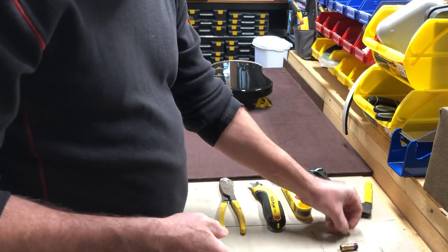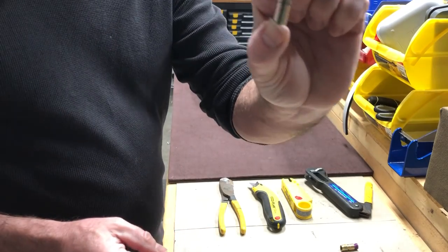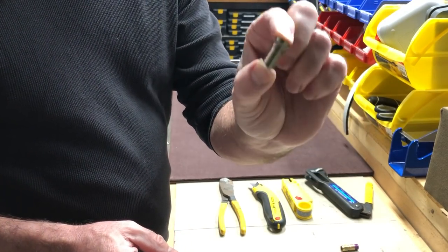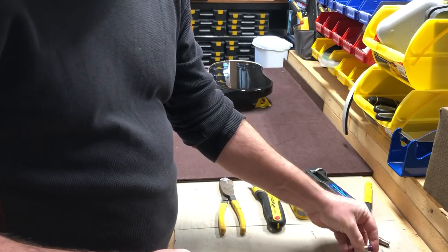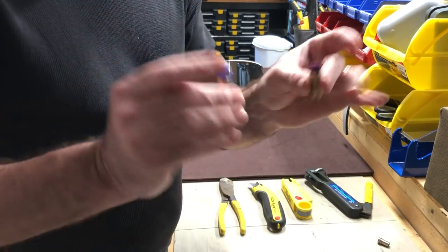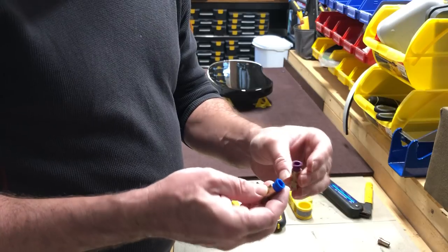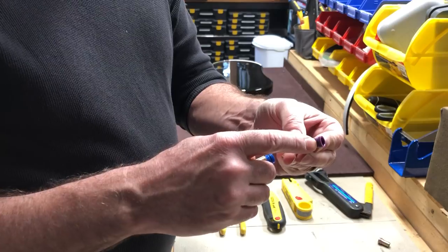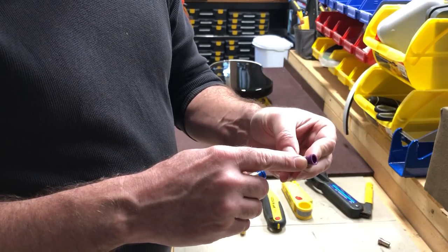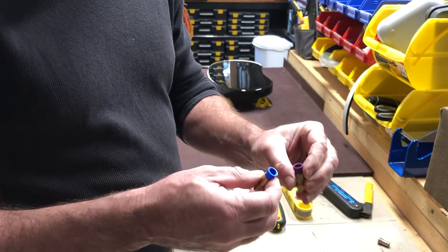The type of fittings — this is a really cheap F fitting, I don't even use these anymore. It's a crimp type fitting. I use waterproof F fittings. They come in different flavors and quality levels. These are pretty decent. They have o-rings so when they're compressed together it forms a watertight seal.